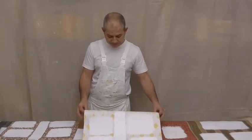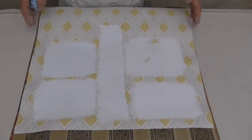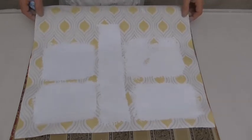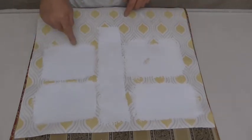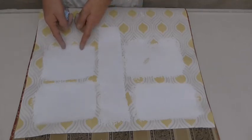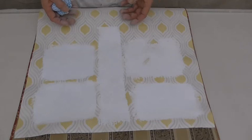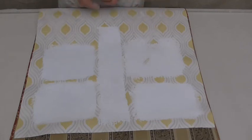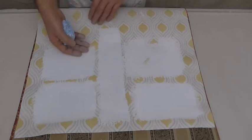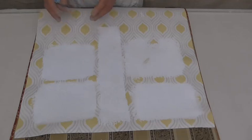But yeah, when it comes to painting, should you prime it or not? Always test an area. So in a room, if you've got a chimney breast and the door here, test it on the least visible side of the chimney breast. Put some paint on, see how the paper reacts, let it dry. With a damp cloth, give it a bit of a rub, but you'll have to give it time to dry. Generally, once it's touch dry and you look at it and it looks fine, you shouldn't have a problem.